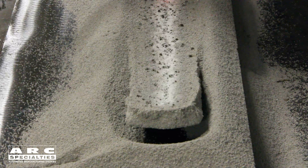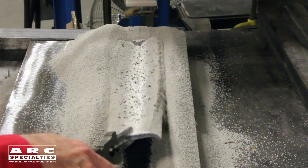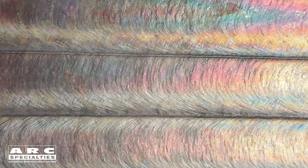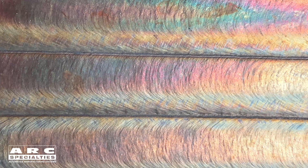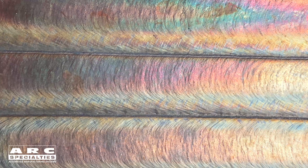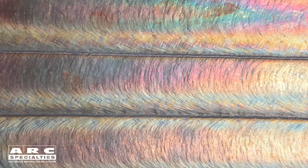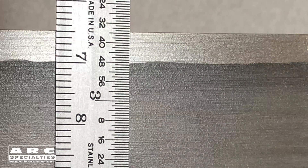On today's video, we're making welds with stainless steel and Inconel. You can see that we optimized our welding parameters, so the slag actually peels off the part and reveals a beautiful weld underneath — absolutely no oxides. There are two reasons for this: submerged arc and electroslag both shield the weld puddle extremely well from the atmosphere, which prevents oxidation, but there are also deoxidizers present in the flux itself. On the cross sections, you'll see a very flat bond line, indicating minimal dilution, so we haven't compromised the overlay chemistry in the least.